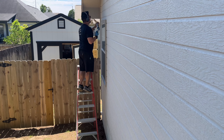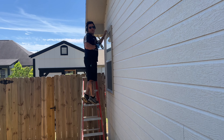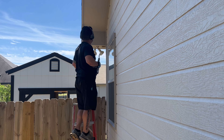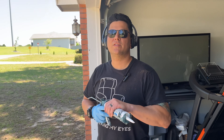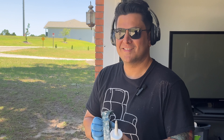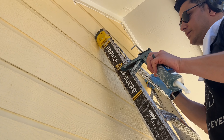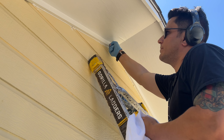We've got another one here - see how that looks? It's fine, there's a little bit of bare wood, but you can just prime it when you're painting - come up here and do the top. It's not rotted, it's just peeling paint. So we're not Lexeling this one. I got up here to caulk this and found out everything's already caulked - I won't complain, I hope that trend continues. Just won't be very exciting footage. I waste a lot of this stuff because I don't know how to do it right, but it's effective against water - not super effective against my wallet.